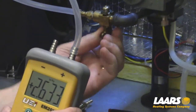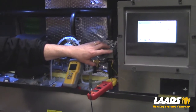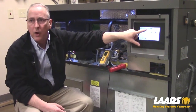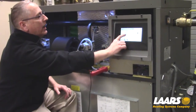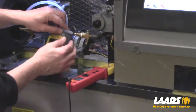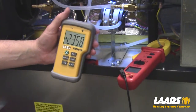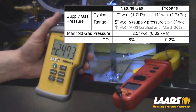Lastly, I'll shut this valve off and go to my third valve. I originally shut these valves off — you can leave them on, but keep in mind you may preheat your loop depending on the time of year and building demand. Also, if you shut these off in stage 2 with lockout, it'll read lockout. In that case, turn your valve back on, hit the reset on the screen, wait, and you'll then see. So right now stage 3 is in the on position and I can check my last valve. I'm zeroed out. I'll go to my manometer, open the butterfly, and you'll see I'm reading between 2.4 and 2.5. We can make a slight adjustment.